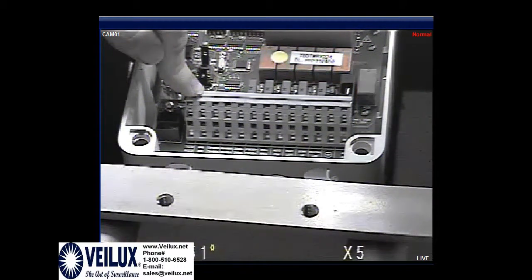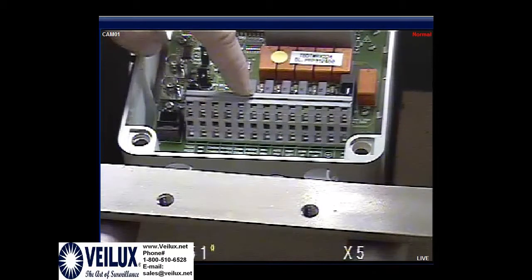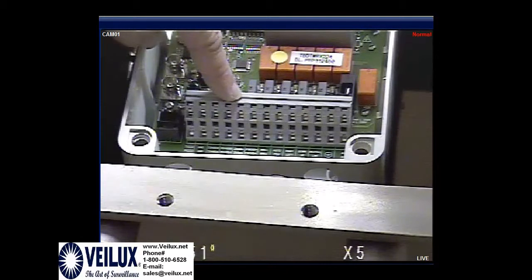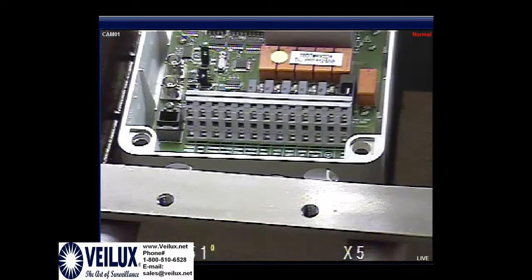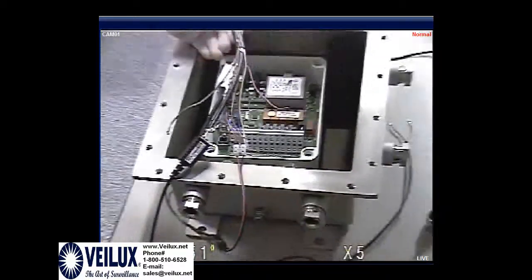On this one, with the Samsung 43X, you will not be using the focus, or the iris, or the zoom. These three will not be used on the Samsung 43X. Instead, they are used in the RS485 connections. So, when we hook it up, we have all these cables. I would also highly recommend buying a balun as well for the video.